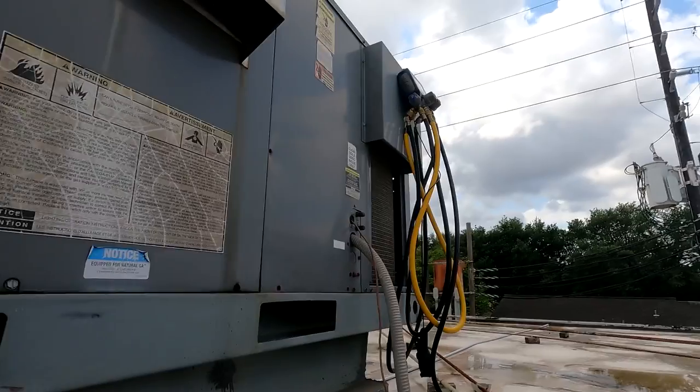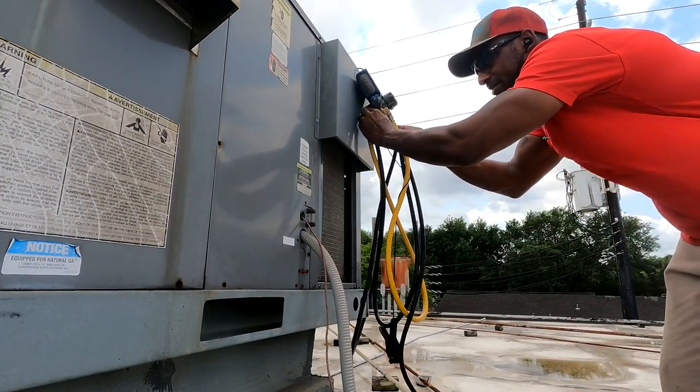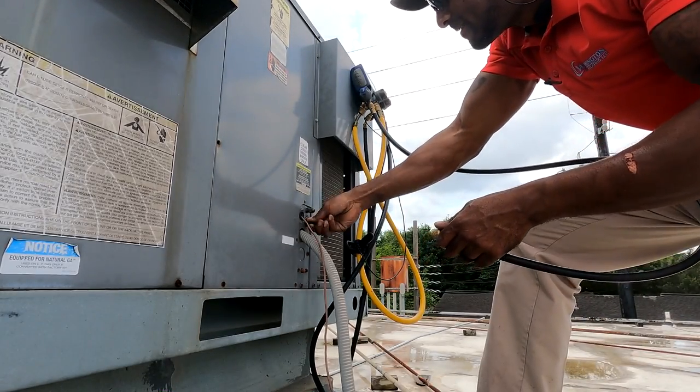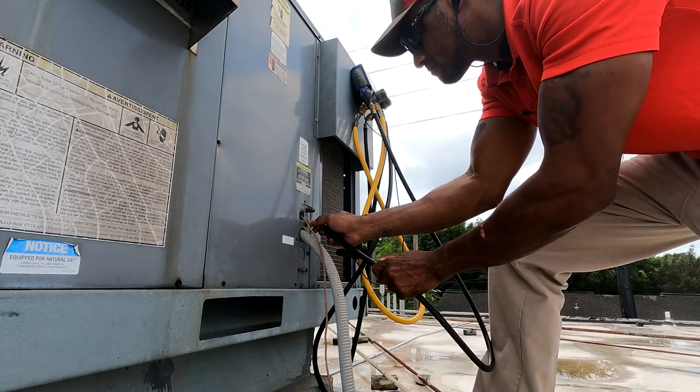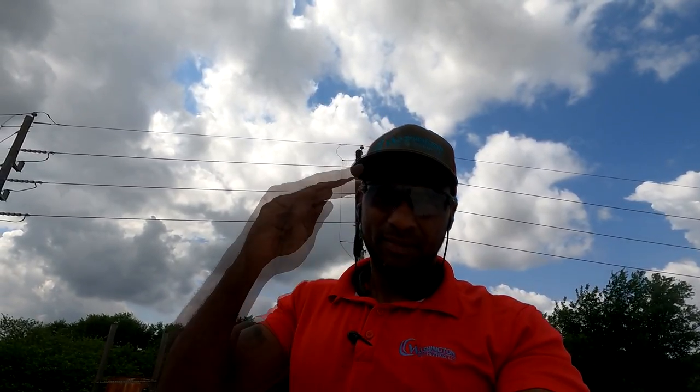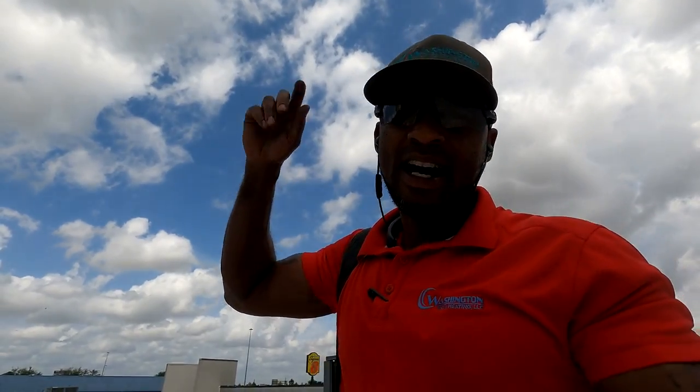Go ahead and check the pressures. Alright, y'all, I had an important phone call. Sorry I couldn't finish up that maintenance, but I was on the phone probably about 15 minutes. But anyway, pretty much got that one wrapped up. I went on to check the pressures on the suction line. That's what I was doing, but it's blowing cool. Really didn't have to do that, but I did not hook up the discharge because I don't want to lose any unnecessary refrigerant. But this was a success.